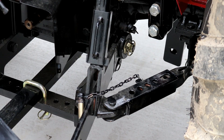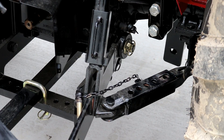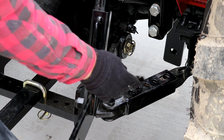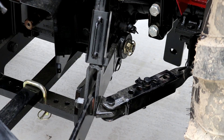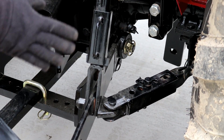I'm trying to come in here from behind it — normally I come around the tire, but I'm trying to keep that open so you guys can see. I've got the box blade lined up exactly where I want it, right here in the middle of the tractor, where the box blade is going to be trailing both my back tires. I've got the closest corresponding holes lined up, just drop that pin down, and you're done. There's a little bit of play — just a little — nothing really is going to make a difference.